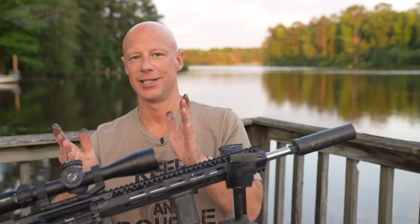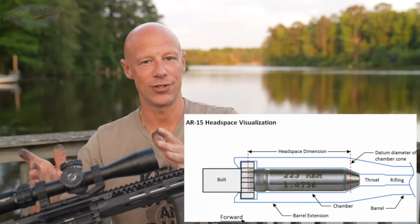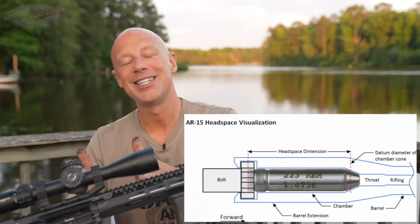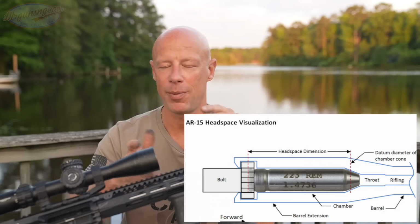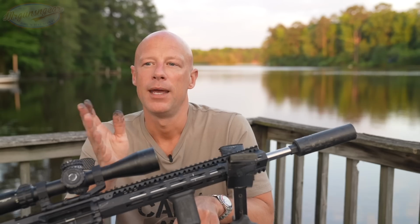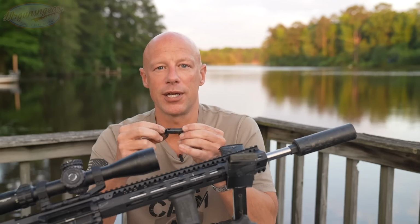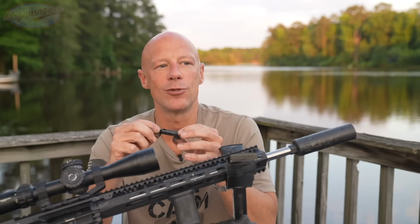So headspace is, well, we're not going to get into headspace for this video. If you're really interested in what headspace is, you can just look it up, but it's a safe space that you want in your rifle, a safe distance that different parts are apart is the easiest way to say it for this video. But the thing with nickel boron is, just like we were talking about the old school application of chrome, how it can be inconsistent, the nickel boron can be as well. And what that can cause in our bolt in particular is a headspace issue with your rifle, which can cause, I don't want to say unsafe because it's not really true, but it can cause just malfunctions is the easiest way to say it.